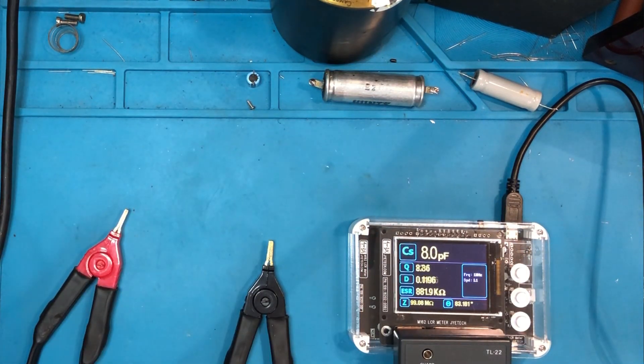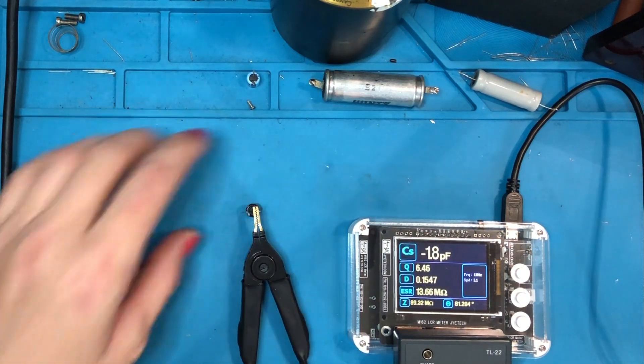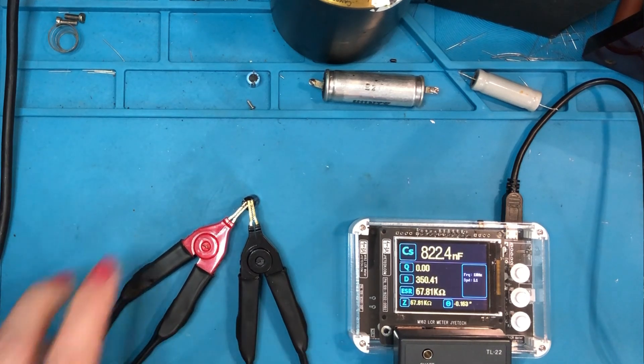Now here's one of a bunch of cheaper-than-cheap AliExpress capacitors — completely unbranded, non-descript, no idea what we're getting. And you can see the difference between buying a known branded capacitor and an unknown from AliExpress: we're only getting 83 microfarads when we were expecting nearer 100. There's a bit of tolerancing, but it's way further off than the branded caps. ESR of 660 milliohms. That's why I'd always go with branded capacitors from a reputable supplier, even though the ones on AliExpress or Wish are super cheap. But are you getting a genuine component up to the spec they claim? You never know.